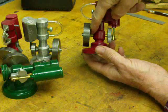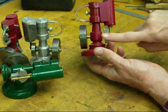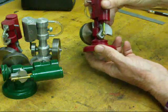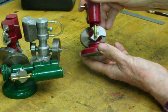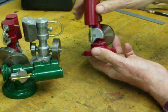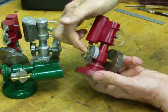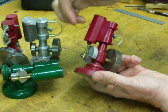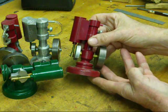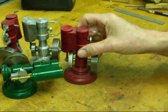That's one thing I like to do, and some of my other parts are Loctited in too. For instance, this brass bearing that goes into the side of the pedestal here is Loctited into place, and that Loctite sets up real fast — in an hour or so you're on to the next step. Also, this piece here is Loctited onto the rod, and the piston is Loctited onto the rod. So I've used that product extensively in these little engines.